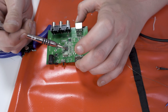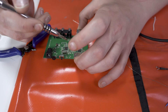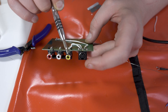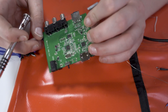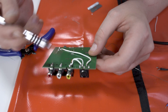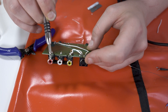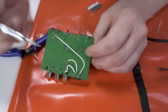I don't know what this chip is, and I didn't want to dig up some Chinese datasheets and try to learn Chinese to fix this thing. So instead we did that — we're basically stealing the signal from the RCA connector and mixing it with the S-Video signal. You might be wondering: with that much interference on the S-Video signal, what about audio? Well, I just have this TV here to test it on, and I'm not hearing any distortion or static in the line. So let's consider this all fixed up.